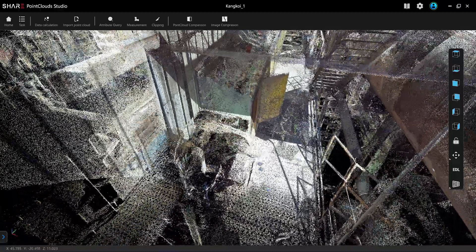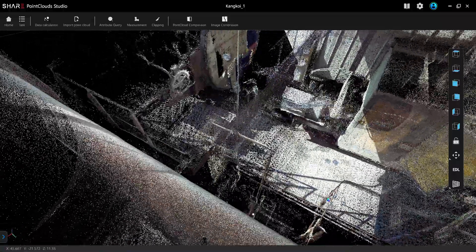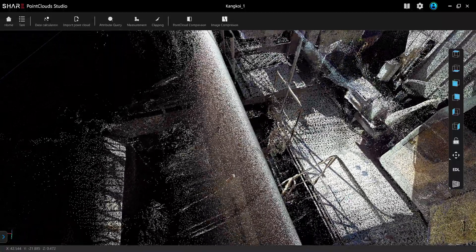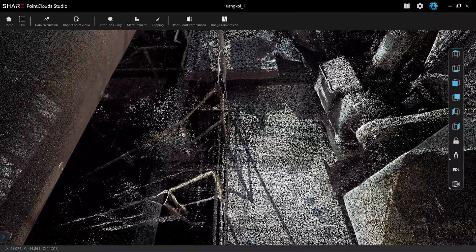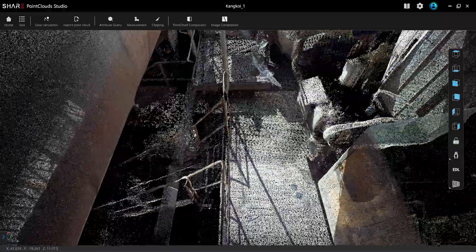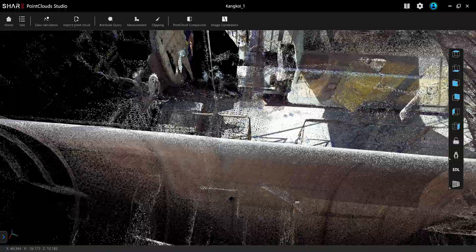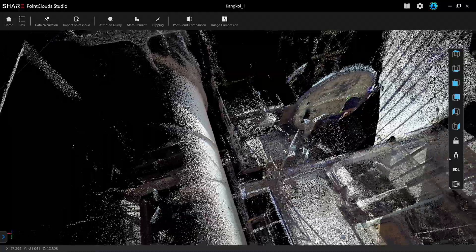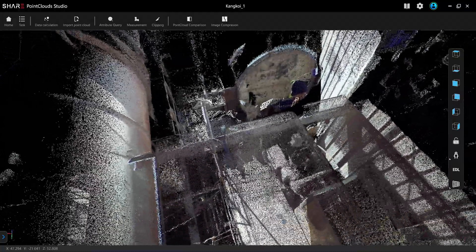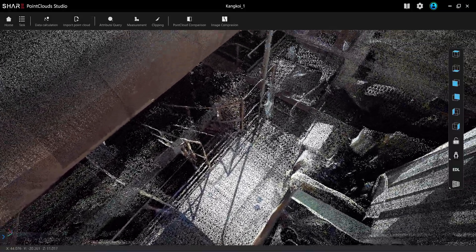This is the place where I put the checkerboard. For the first scan, I need to see three checkerboards, but I can only see two clearly — the third one is very faint. It's probably the lighting condition, because the sun shines directly on that floor. With the S20, you have a control point collection function and don't have to click the mouse on the checkerboard to align the two scans together — that would be an advantage of the S20 over the C1.